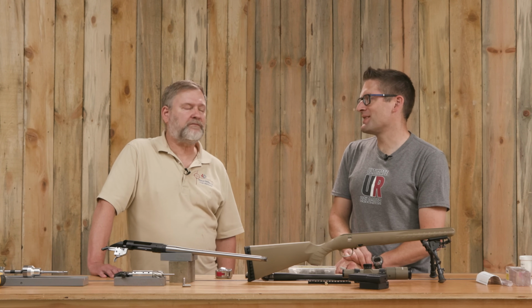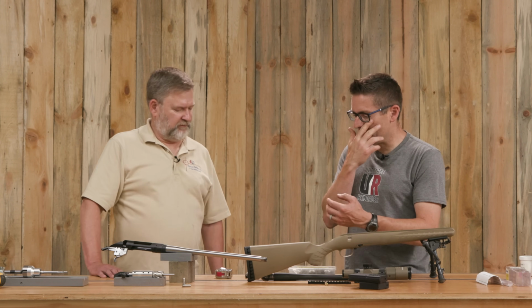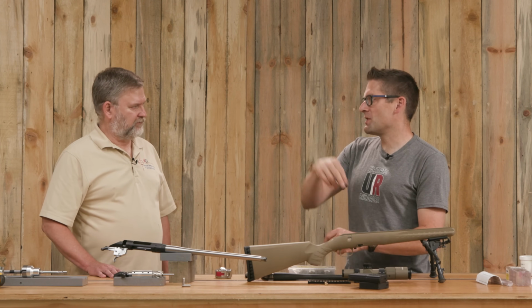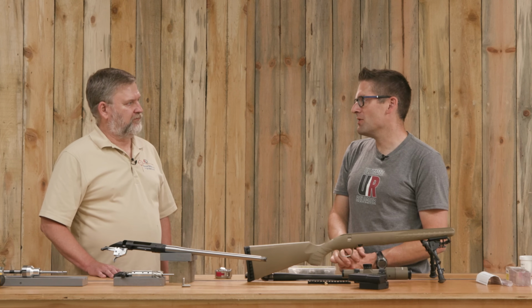If you're getting started with machine work and gunsmithing, I like to have sets of tools. I was looking for my 1/4 inch shank 60-degree threading tool. Couldn't find it. If we had found it, that would have been the best. A great little project is to take whatever shank size you have for your tool holder and mill out a pocket for a 1/4 inch tool, and then your 2 screws hold it right down in there, and you can even have the same top distance and not have to raise and lower it too much. But I couldn't find it, so we used a 1/2 inch shank tool or something like that.